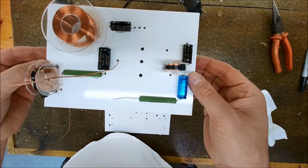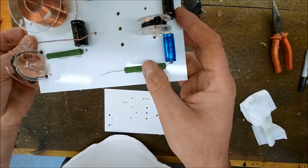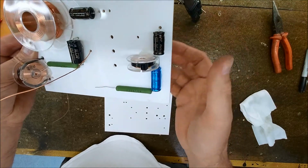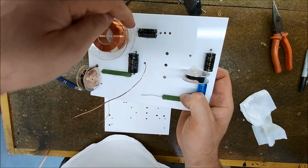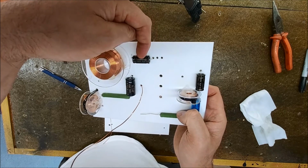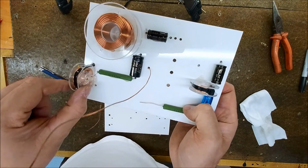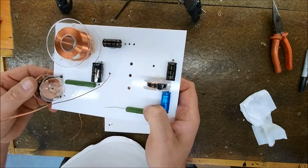Right, so this is one all glued up and kind of ready. So tweeter circuit in through our resistor, 4 μF, inductor down to ground, 8 μF, and out to our tweeter. And then on the woofer, in through our inductor, out to our woofer, capacitor down to ground, 8 μF. And then also we have our notch filter here. So 40 microfarad, 10 ohm resistor, our inductor down to ground. So yeah, that's what it looks like.